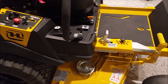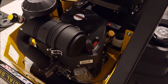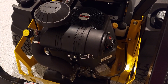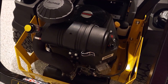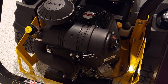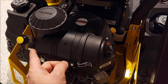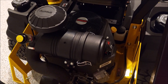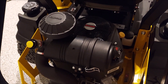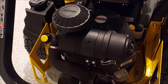I'm really digging the Kawasaki FX691 engine. I pulled the Donaldson filter out to inspect it — I always wipe down the canister. Inside these filters there are three little notches on the filter and three inside the housing. It's not critical, but lining them up lets it seat a 16th of an inch better. Don't pull it out just to inspect it though — you can do more damage by allowing dirt in. The end caps should go on loosely and snap on very easily.